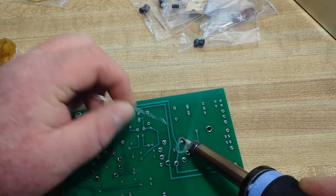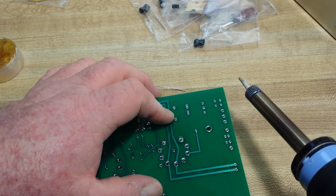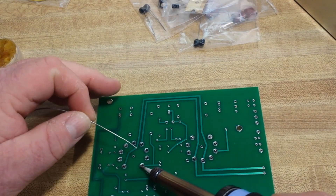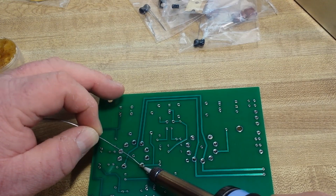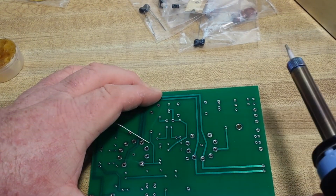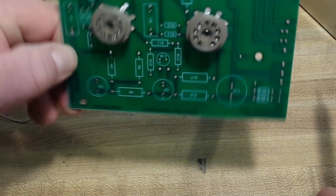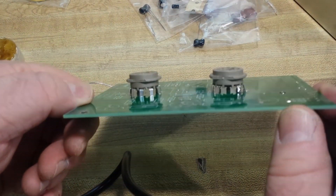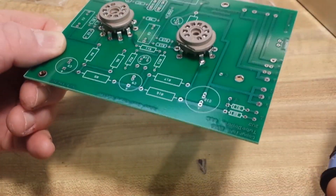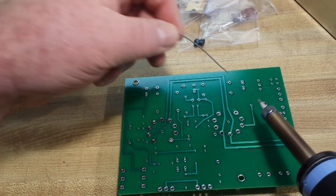Let them heat up, apply a good amount of solder. I'm going to push it down and let it cool there for a minute. I'll do the same thing on one of these, let that cool for a second. I want to make sure my sockets are looking nice and even — and they are. They recommend that you make sure you have solder coming all the way through the plate. Now we're going to solder these sockets.